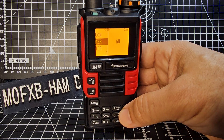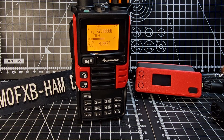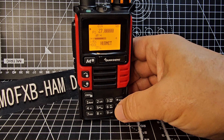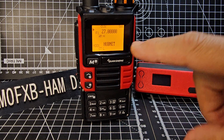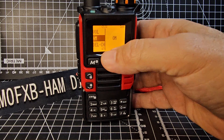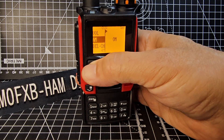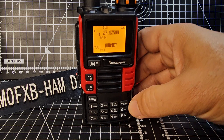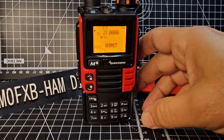That's your dual watch. You can see weather there as well. ABR is basically your screen timeout — we've got 60 seconds on this one, so menu 16 is your screen timeout. One question was: how do you scan 27 megahertz? So type in the frequency first — go 027.000 — and then go to menu 47, turn on AM, menu then exit. To scan, hold down the star — there you go, scanning in AM now.